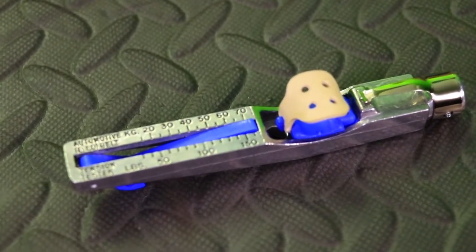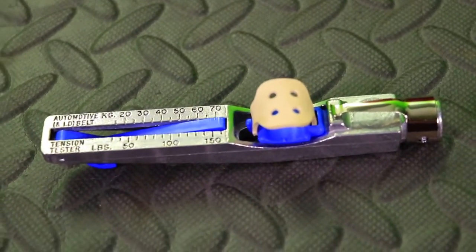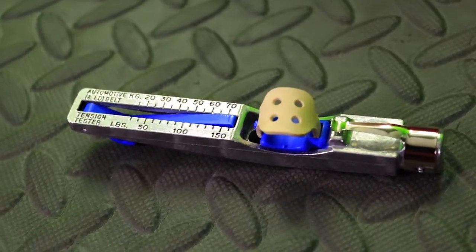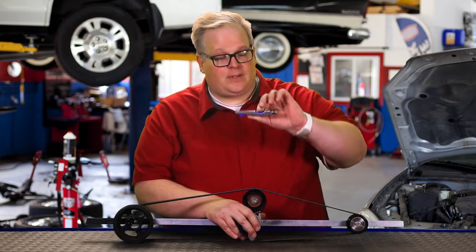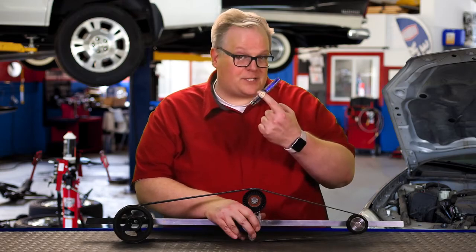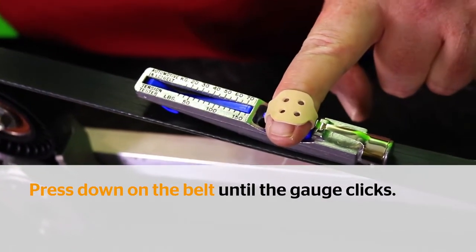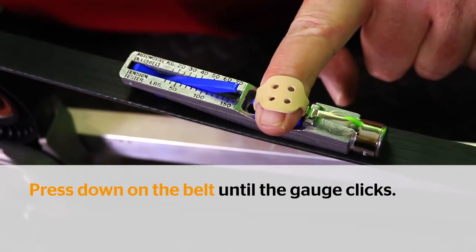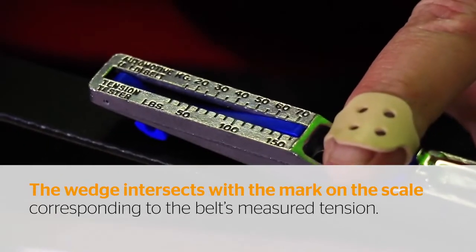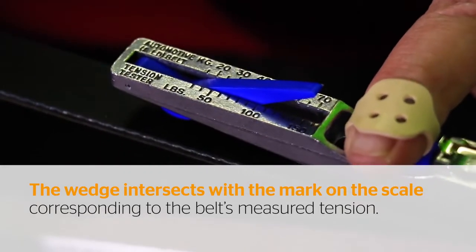This gauge can measure the amount of tension in most belts, and there are going to be readings in most belt suppliers' catalogs that correspond with the readings on this gauge. To use it, make sure it's fully pushed down so it's flat with the readings on the tool, then put it on your finger in the special band and position it on the belt. Hold it flat on this edge and simply press down. The little gauge on the end pushes up, and the marks on the scale correspond with the amount of tension on the belt.